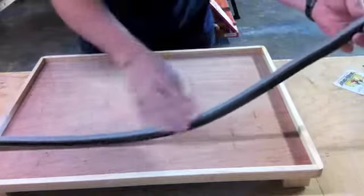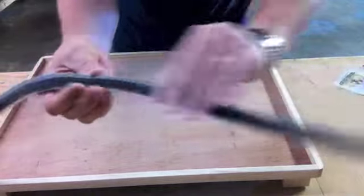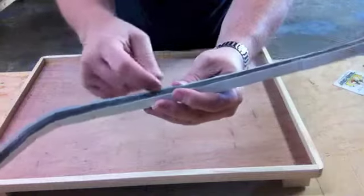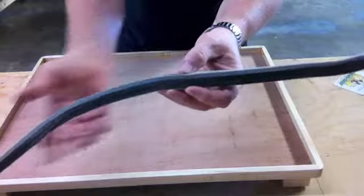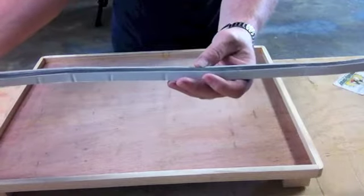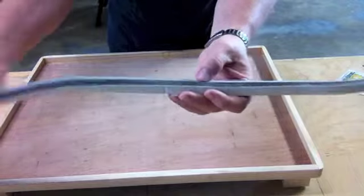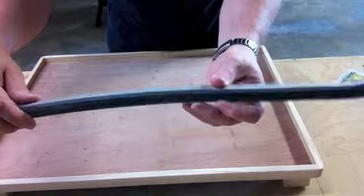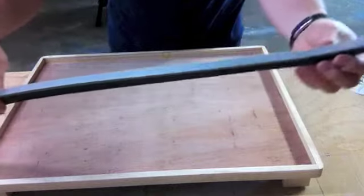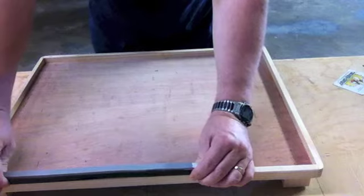So you'll take the paper off the gray side, and as you can see, the foam is a two-part foam. Sorry, it's all dirty. The black on the bottom and then the gray on the top. The gray is the same foam that you can buy at Home Depot or Lowe's. It's the 1/2 inch by 1/4 inch, and it comes in a 17-foot roll. The black foam we have custom cut for us, and we have a little machine that puts the two together nice and straight. And so replacing the foam on a Duc-Bloc pan is very simple.